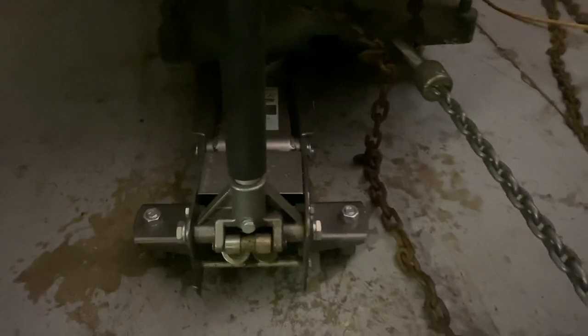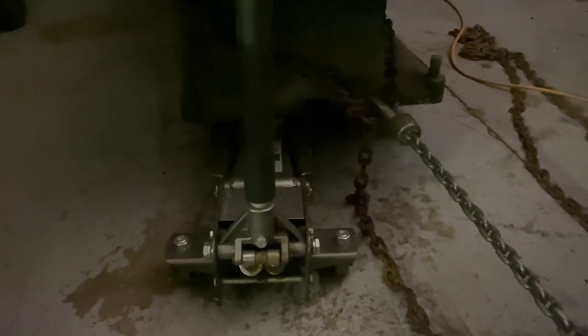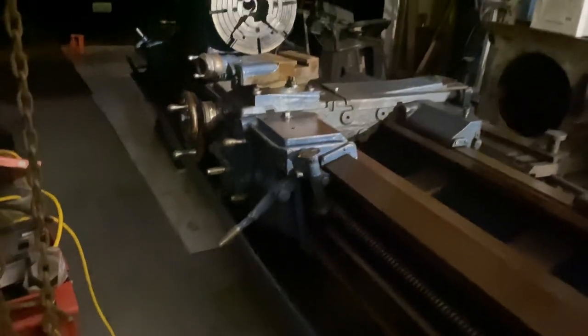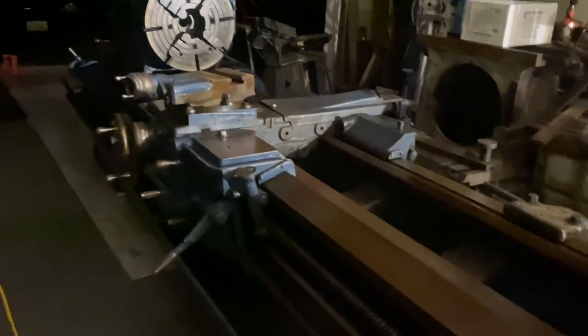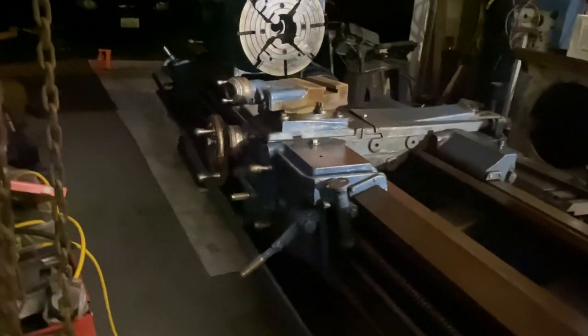You can see it's just one-handed. I'm moving an 11,000-pound machine across my floor, and with the jack all the way down you can actually kind of steer it — very cool. So if you're thinking about moving something heavy, I would seriously consider this, because most of you aren't going to move something this heavy by yourself. A forklift is of course on the list, but it's amazing what one or two people can do with just something like this.